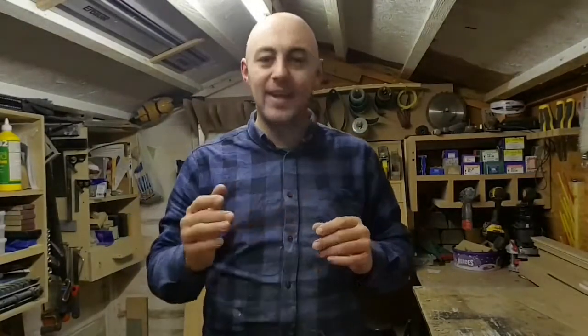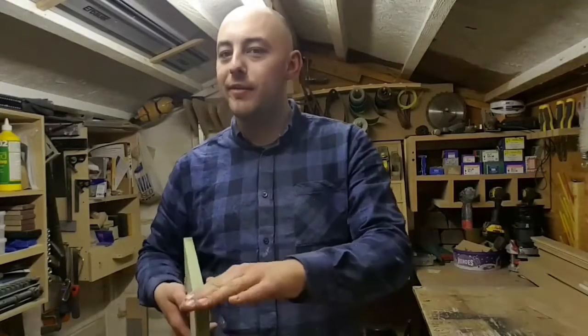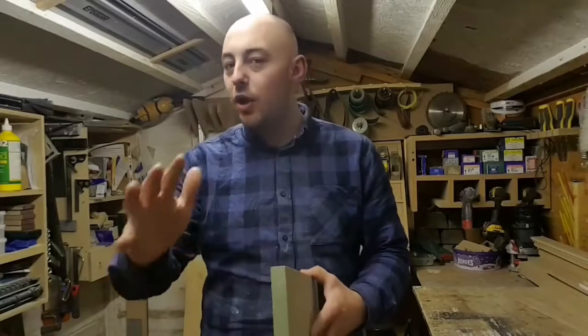This is moisture resistant MDF, so it is a lot denser. The fibres are compressed from the saw anyway, but because it's denser it takes paint a lot better — that's a known fact in the trade. If you're building, this might be worth a shot straight off. Any advantage you can get when painting MDF is a godsend. It works out to an extra three or four pounds a sheet for me for the moisture resistant stuff, as opposed to normal MDF. It's better quality than you get from big stores like B&Q, and better still than standard MDF.